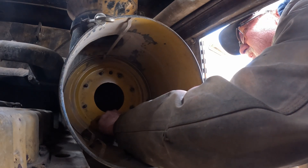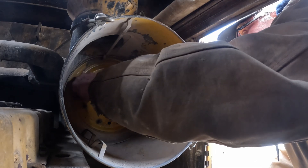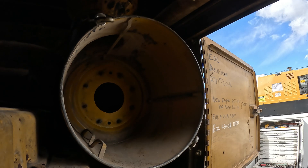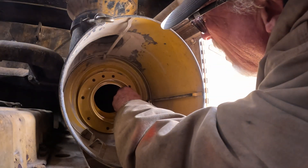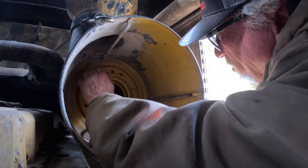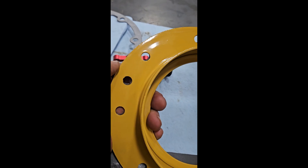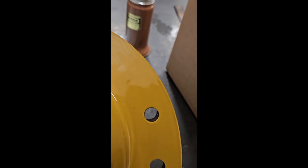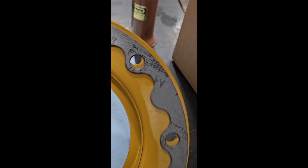It's not gonna move — I guess there's probably some glue in there, never coming out. The box says there's supposed to be a decal in there that tells people it's been converted to radial seal, but there's no decal. The gasket on it is crooked — I don't know if it's gonna go in. So I'm going to change the 14 over to radial seal air filters. I think we're going to have a serious problem getting this over the studs because they've glued the gasket on so crooked.